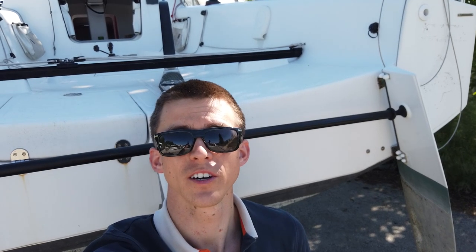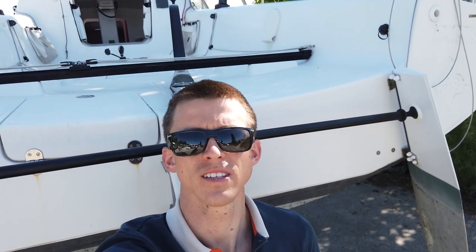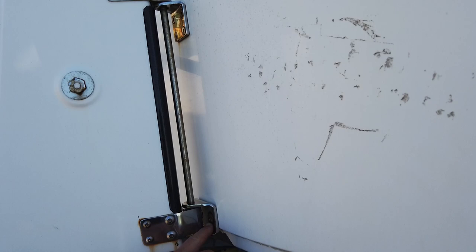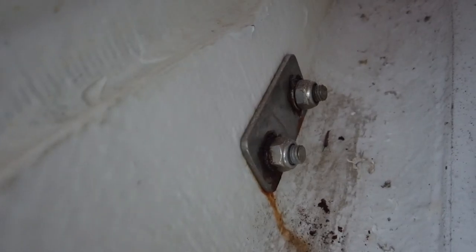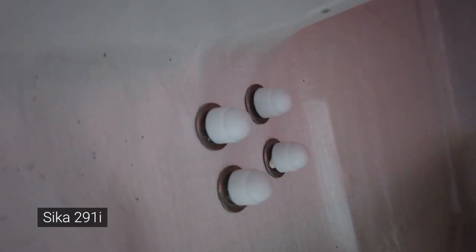The steering system is another crucial component of every sailing boat, and luckily the FIRST 27 has a very straightforward and easily accessible one. First check that both of the rudder hinges are completely tight and sealed — this is most easily done by checking the screws on the inside, which is accessible through the stern locker. Because the hinge is almost on the waterline, you need to reseal it completely. Again, use Sikaflex 291.